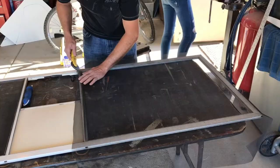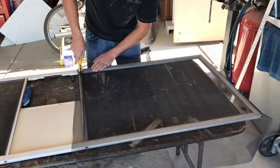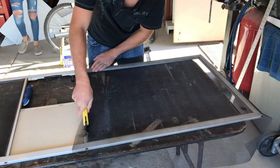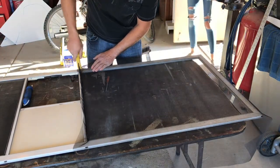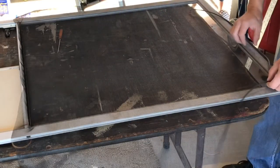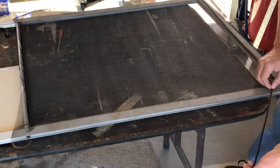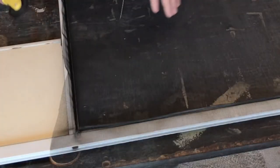Center your screen material on the door and just pick a corner to get started. On the first pass pushing the spline material in, I don't go super hard — I just lightly get it started, then I go back a second time and push it all the way down into the groove. If your spline material is all one piece, you'll just work it around the corners. I use a screwdriver to push the corners down because sometimes the round tool will not allow you to get right up to the corner.